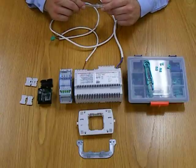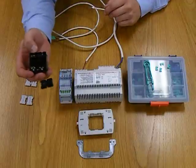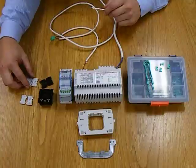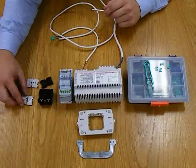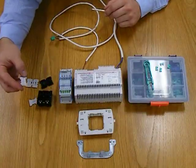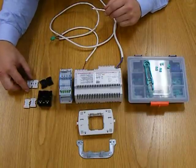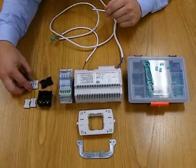The parts required for this particular exercise are an L4652-2, that's a one-gang or a two-gang switch. That comes with these little devices, be it the grey or black devices as you see on the switch. The grey only allows point of contact on one of the edges, and that's available in both a one-module size device and a two-module size device.